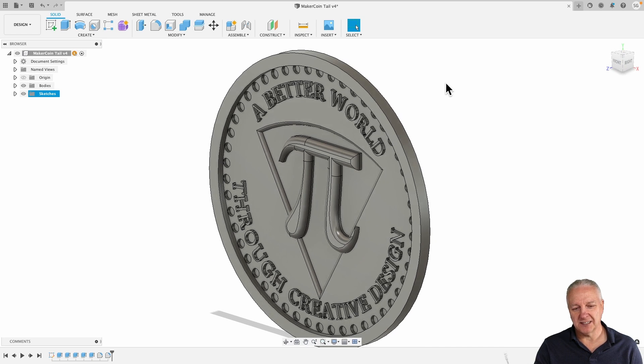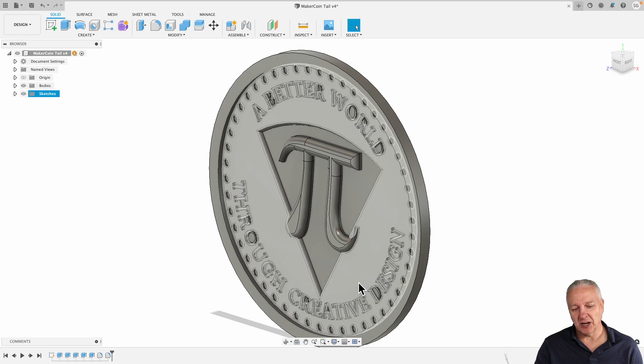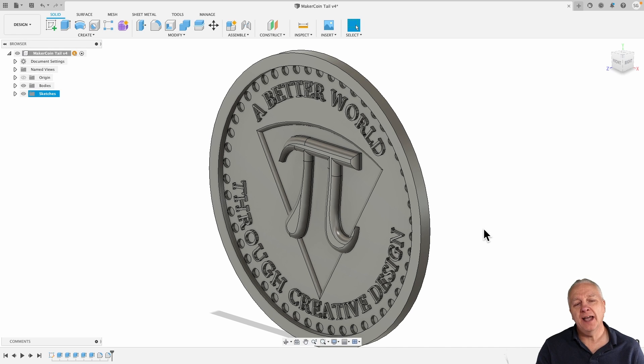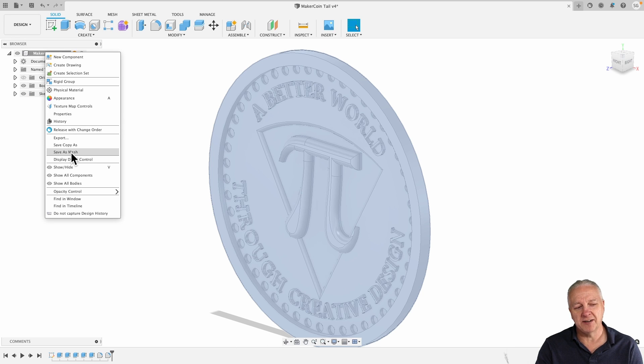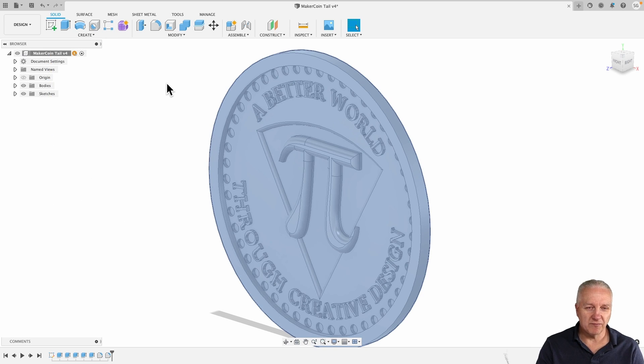This is the Fusion 360 design — note it's only the first two millimeters of the material. The entire coin is six millimeters thick, but you don't have to model the center. I did something similar for the back, except I took all the text and my logo out and it's really just the circles with the dimples around the outside. What that allows me to do later is import that surface into V-carve Desktop and then drop a 3D image on top of it. Fusion doesn't really handle mesh very well if it's got a million data points, so I just created the plain surface and exported it as a mesh. I had two separate files — one for the front of the coin and one for the back. I actually stop in the middle, flip the coin over, realign everything, and do the other side.